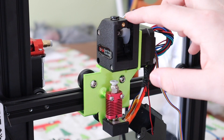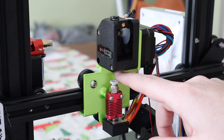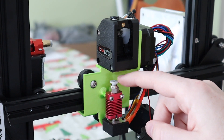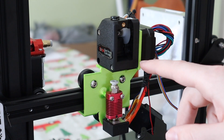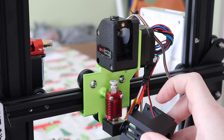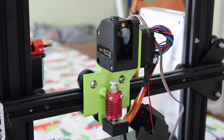We're getting a lot closer now. We have the extruder and extruder motor mounted. The offset between the X carriage and where the bowden tube is going to come out of the extruder is about a millimeter off from where it enters the hot end, so I'm going to have to bump this out about a millimeter. Also, the bolts that go through the extruder into the extruder motor are a little short, so I might have to thin out the piece between the motor and extruder, or find longer bolts. The next step is designing the fan shroud and mounting points on the X carriage, and I also need to think about where to mount my BL Touch — but we are very close to a working direct drive X carriage design.